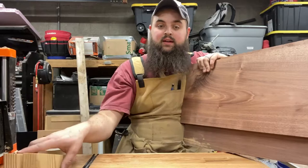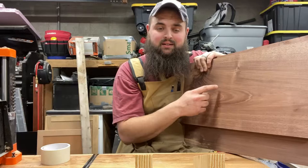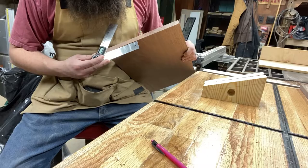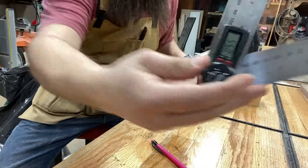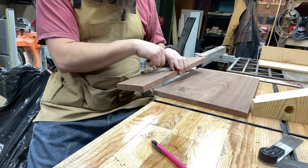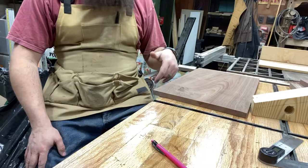Since I know the top spine is a 20 degree cut, I cut two little spacers at 20 degrees so I can set the piece on there and figure out what angle I need for the groove. I put my angle gauge on the face and slide it to find where that angle is — it comes out at 55 degrees. So we're going to cut that 55 degree angle along this board, cut another board similar to this with the angle flipped over, then figure out how wide a bottom piece we need and cut that angle.